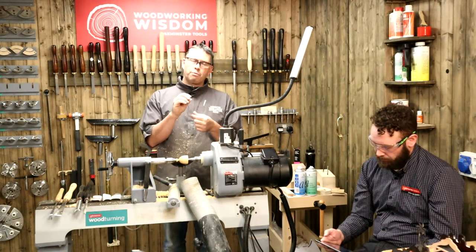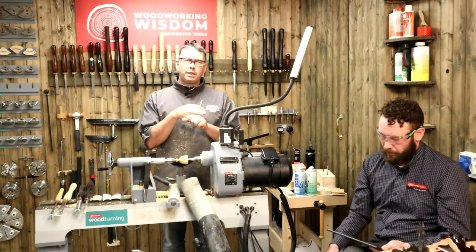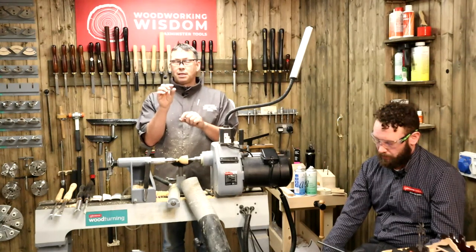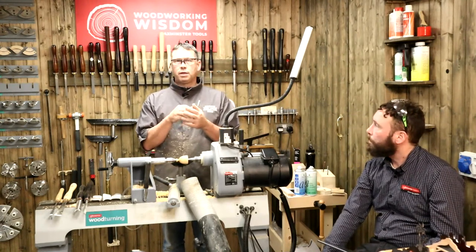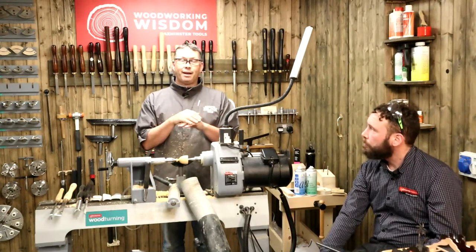If you're going to use something like a benchtop grinder, I'd be tempted to go for CBN because that keeps that steel really, really cool. You're only talking tiny, delicate little amounts of steel there, and it's very easy to get those heated up if you use carborundum or aluminium oxide. So if you can go with something like CBN or water, you'll benefit there.